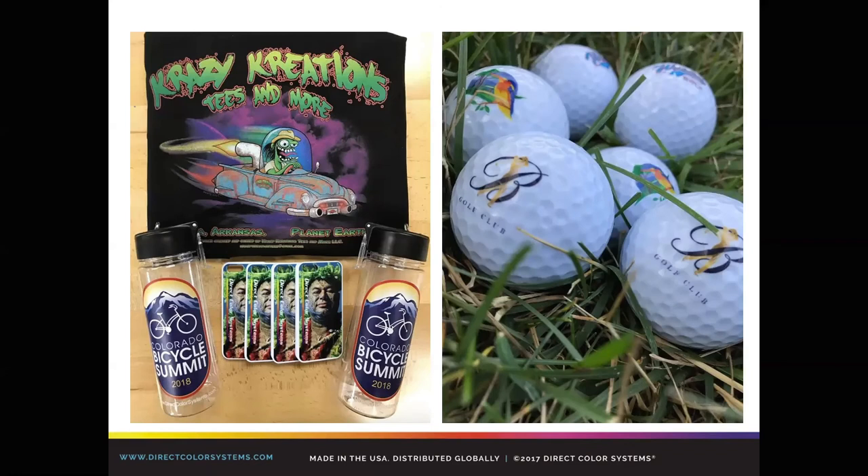Adam has a lot of familiarity and knowledge of many other UV printers on the market. Adam, in terms of versatility compared to other UV printers, how would you rate the DCS equipment? Adam responds: I'd rate DCS printers on the higher end of versatility, because you have the ability to do cylindrical, flat, ADA, textured, and even textile printing. There are not many printers on the market that can do all of that. As far as I know, DCS is the only one able to do braille and DTG on the same printer — it's definitely the most versatile machine I'm aware of.